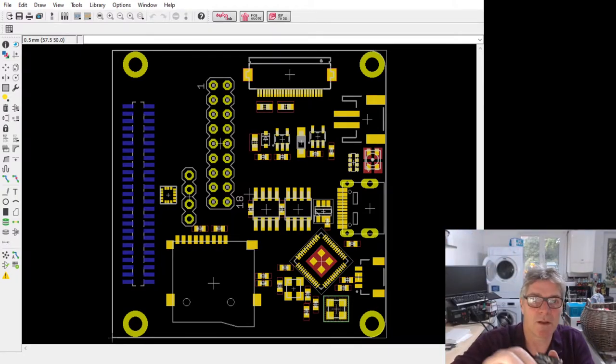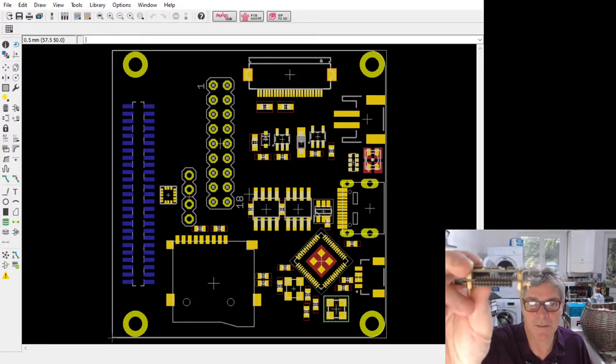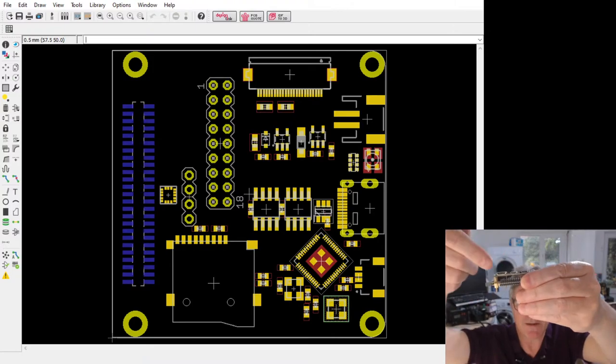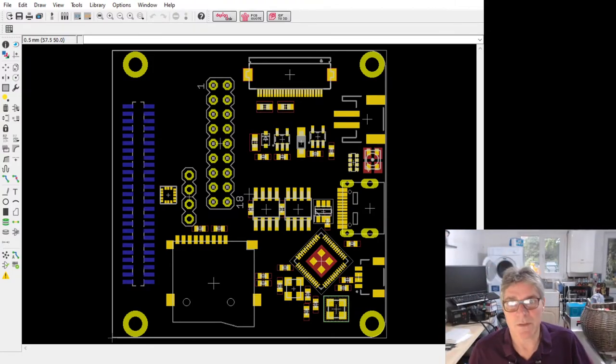Now, in some cases, that has components on the top, right, in this sandwich. But I might want to have the components... so this top board will be upside down. Now, why might I want to do that? Let's take, for example, this super board here, this super tile. The trouble with this current layout, the way I've done it here, is we've got all these components and they're all on one side apart from the super tile connector. And it's the same for any tile, because the tile connector points down, connecting to the board, right? But the trouble is that makes this assembly double-sided, which makes it even more expensive or a two-part assembly job, which is a bit of a nightmare.